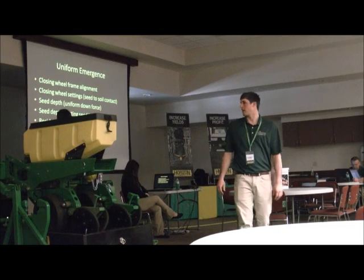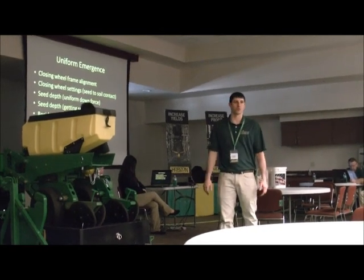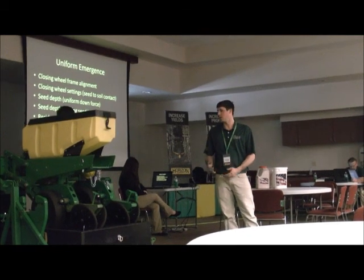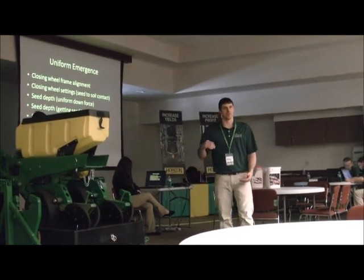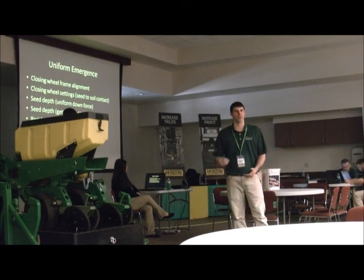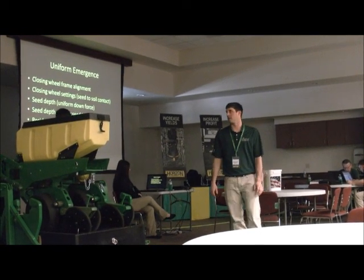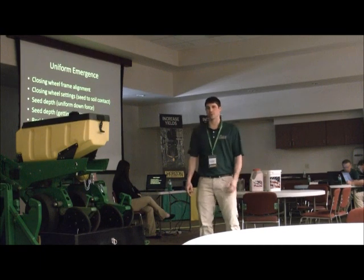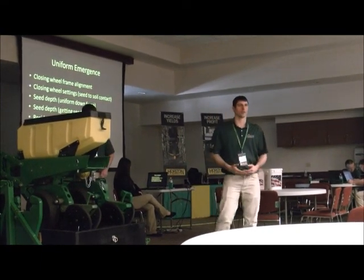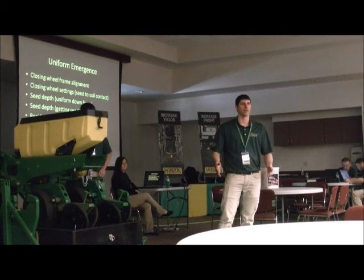Residue managers, like Brian said: if we have coulters or trash whips, we want to make sure we have those adjusted right, so you're not digging a trench and your seed's not getting too deep. I mean, if you have your coulter set below your true V's, then you're going to end up deeper than where we're wanting to get. Also with our residue managers, we want to make sure that we're clearing that area in front of the true V's so that they can do what they're designed to do and that we're not digging a trench for it.